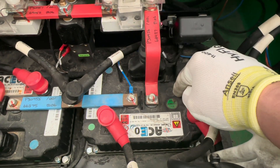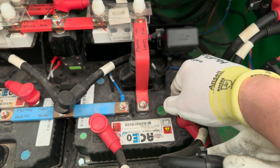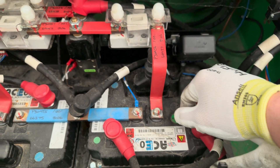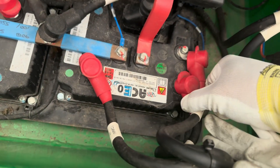Code 399: the number three means the master controller is the one reporting the error, and the error code is 99. In most cases, 99 means there is a hardware failure inside the controller. I'll have a quick look around the plugs and wires.